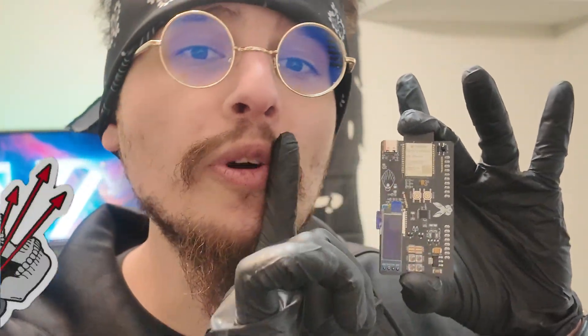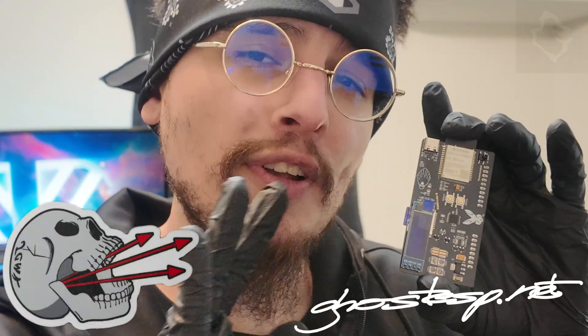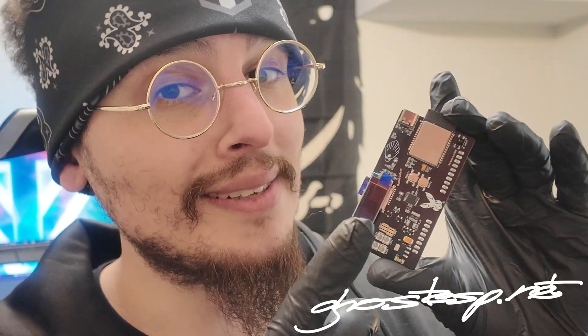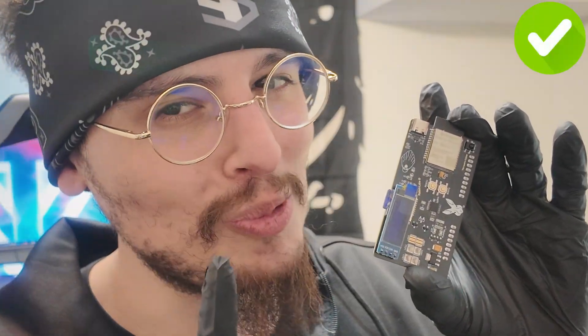With the Poltergeist board, you can flash the ESP32C5 with Marauder by Just Call Me Coco, or you can flash it with GhostESP. If you flash it with Marauder, you're limited to ESP32C5 sniffing and de-authing — just that. But if you flash it with GhostESP, you can use it as an IR blaster, which also means you can use it as a standalone device, which is pretty cool.